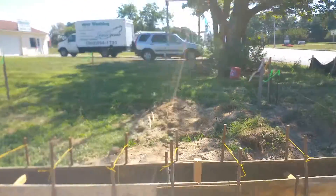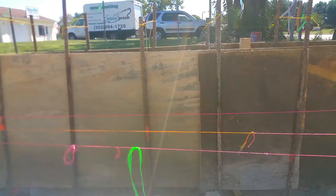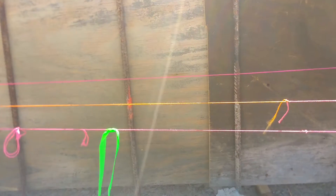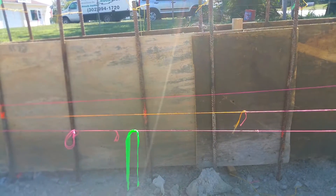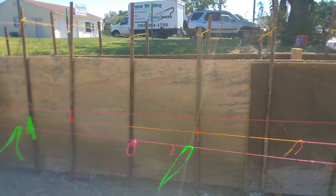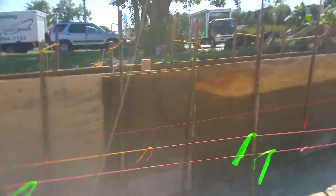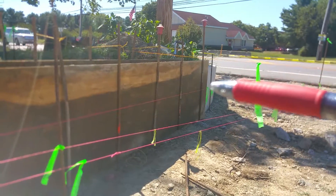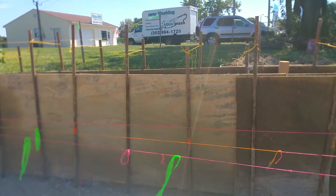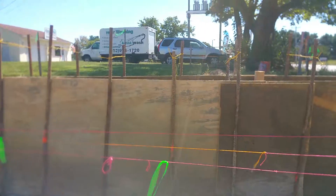Resolving the ramp — we've got existing earth that we have to line up with one way or another. I put three string lines on: the one on the board and the back board, which would be the very top in our view now. So eight inches is roughly where eight inches is down from here, and that same backboard piece is roughly eight inches down from there where it meets existing. Of course, that's a ramp — a ramp would have to fit in there along with a 4 to 1.